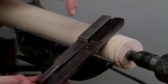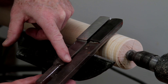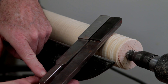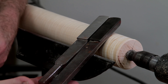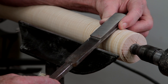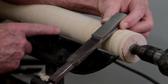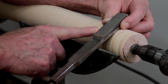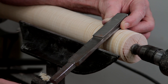These are Big Ugly tools I've made with a one-inch wide bar stock. It's kind of hard to fit a piece like this into a handle and have room for wood on the outside, so I cut them down using my jigsaw and a metal cutting blade. It's a painfully slow process, but it does give a better seat into the handle and you don't have to have a great big wide handle. This particular one, after I cut it down, I actually put this one on with some JB Weld. This is an experiment in progress — I don't know how well that will hold. I did use JB Weld to try to put a tantung tip on one of my McNaughton coring blades and it did not work at all. I would think on this it would be fine, but again that is an experiment in progress.